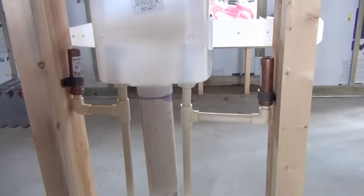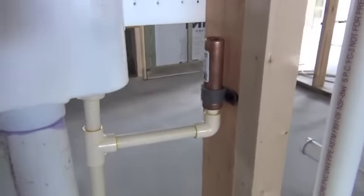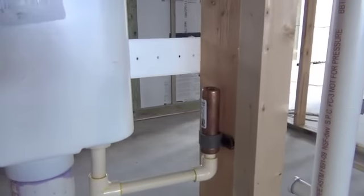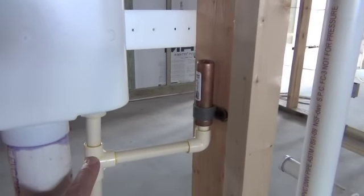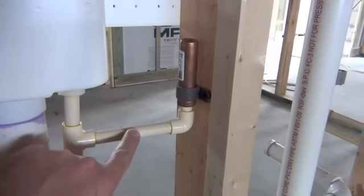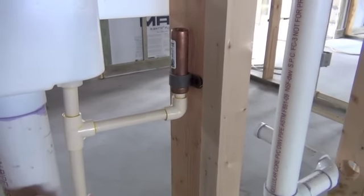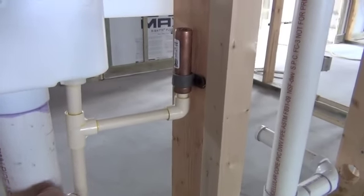a water hammer arrestor. And so what this is basically is a device that would allow the water, as it travels, it moves at pretty good speed sometimes, has pretty good velocity, has a pretty good mass, and so that can actually set up an unwanted feature of getting the pipes to rattle.